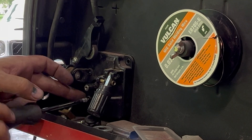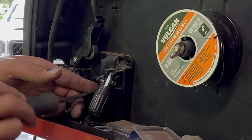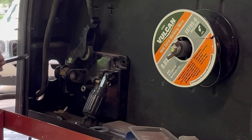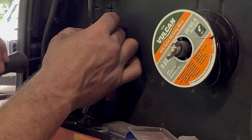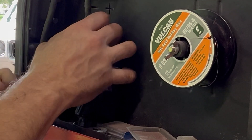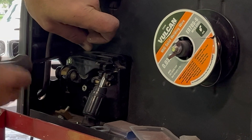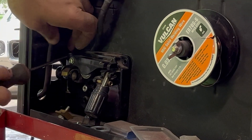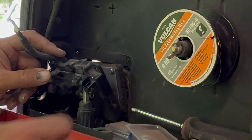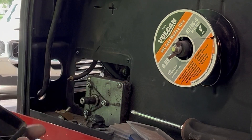I have means of manipulating the location by grabbing the motor shaft so I can move it around - it's not like it's going to fall down inside the welder. This top one does not want to let go, it's just spinning. I'm going to put some tension on it. There we go, I think it's turning now. It appears the hose is just a barb fitting and there's even a clamp on it - there's the old part.